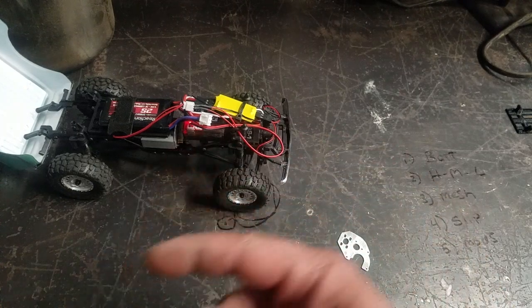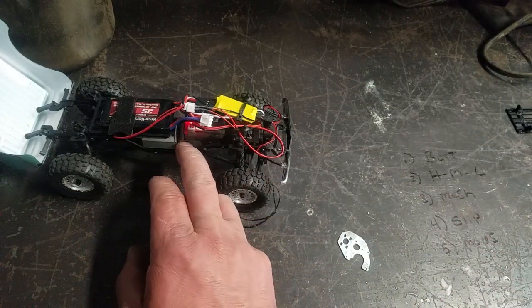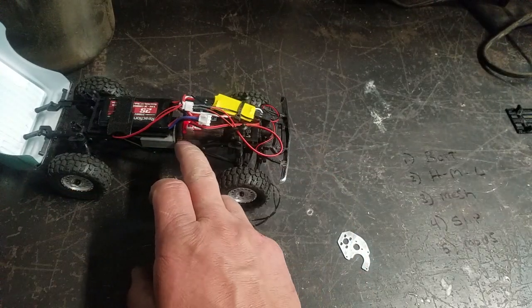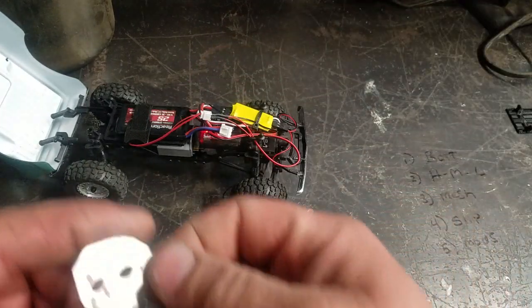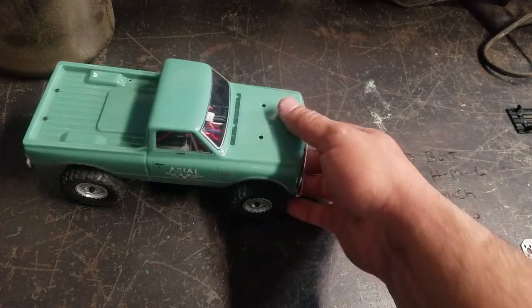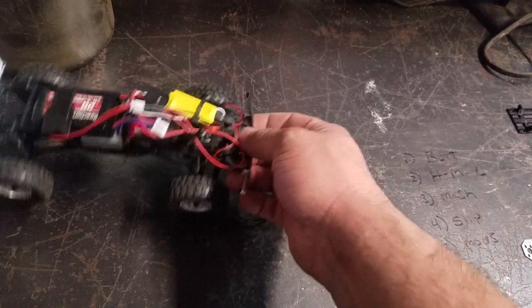If the gear moves on the shaft, reach out to me. I have a fix for it. Basically, you can prick punch the gear with a tiny center punch, and it closes up that diameter a little bit, and it'll tighten back up on the shaft. So hopefully some of these things help everybody out. These are some of the simple at-home troubleshooting tips, and I hope to keep everybody happy.